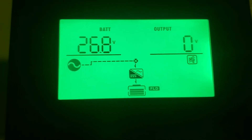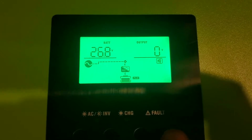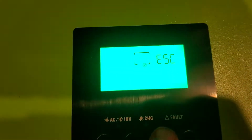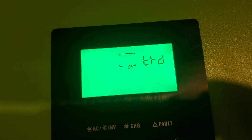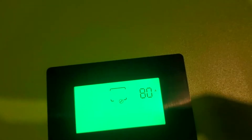I've already enabled it before just to show you what it's going to look like. The inverter is off. What we do is go in here and hold down the enter button until it flashes — now we're in the menu. We hit the down key and scroll up to item number 10; oops, we went to 11.